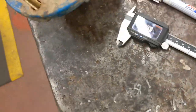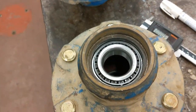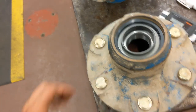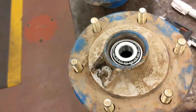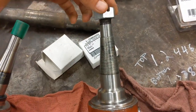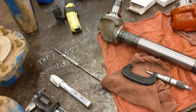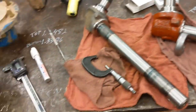To put these back together: just drop your cage in. That's how that goes back together. Then this seal you can just push in by hand and that will hold your bearing in on this side. This one just drops in - there's nothing to hold this in, because this holds that in. Whenever we put these back together, I'll put the spindle on the knee first, then we'll stick the hub on there, then tighten this down - that's what actually holds the whole assembly together.